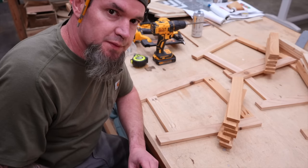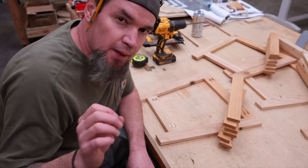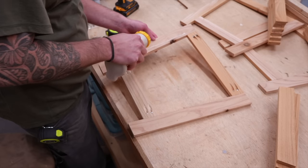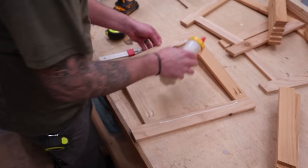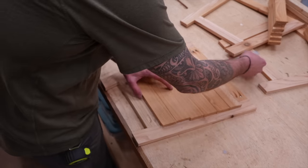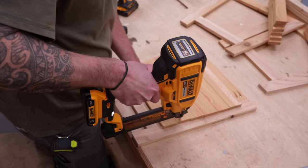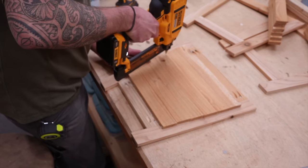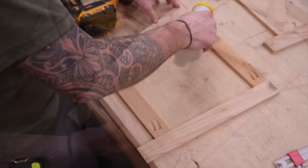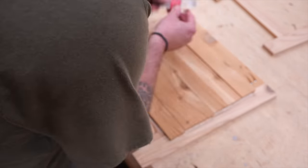With the frames for all four sides assembled, let's go ahead and start putting our slats on. We're going to use wood glue and a one inch brad nail. Make sure you set your brad nailer to install the nail flush so you don't go through the other side of your material. We're installing slats G through K on the side of the frame with the pocket holes. Glue around the frame, measure up an inch and a sixteenth from the bottom of slat K to the bottom of the bottom board, center up all the sides, and lock everything down with brad nails. Our first sidewall is finished — then just repeat for the second sidewall A and both sidewalls B.